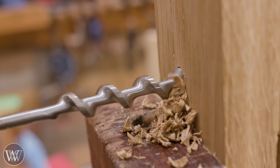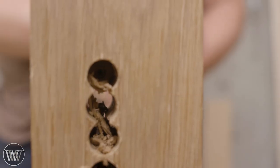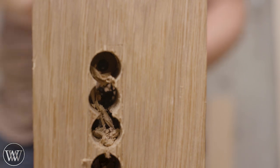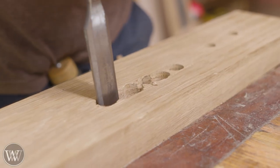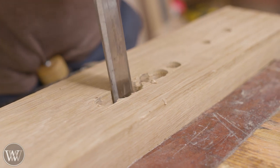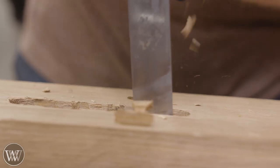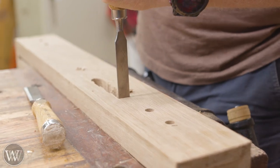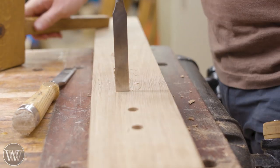Because this is a larger mortise going all the way through, I'm going to do a lot of boring work — five or six holes, top to bottom. I go halfway through from one side and then come halfway through from the other side. It's always pleasing when the two holes line up exactly. Removing the material in between is actually pretty easy. Just don't take off more than you need to. Remember it's easy to take off too much, and if you do you can't add it back on. Take off little by little, get closer and closer to the line, and then go right into the line and take it all the way down.